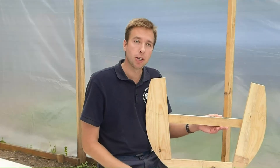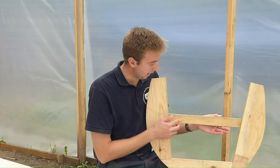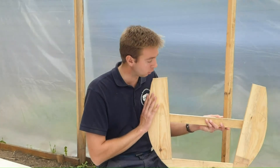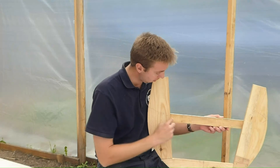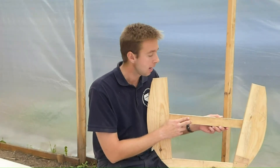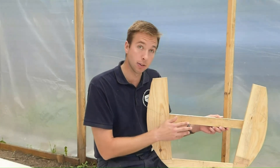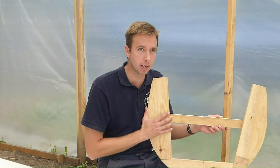The station molds are all finished now. You'll notice that I've added a cross baton to all of them, and that is mainly to help strengthen the station mold because they will be under quite a lot of pressure when I bend the planks around them. I have also put them all so they line up exactly with the same waterline - I've chosen waterline 6. And that's going to be helpful when it comes time for me to set them up on the backbone. I can't do that yet, though, because I haven't made the backbone, and that's what's going to be coming up in the next video.